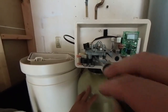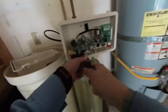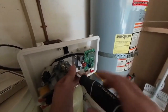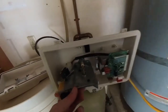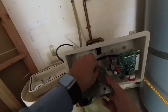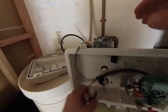Next, remove this bottom plate — there are two screws, one on each side. Make sure those screws are fully loose. Then remove this top screw right here. Now this whole plate can come out — just wiggle it out. Remove the two screws that are hanging there and set the plate aside. Move the switches out of the way.